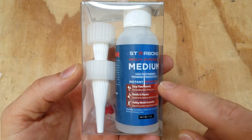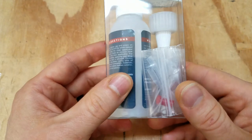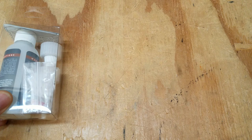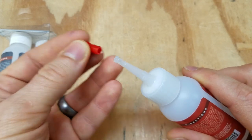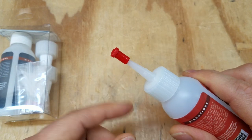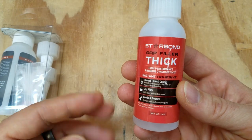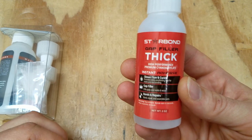Each of these two-ounce bottles comes with two separate caps and nozzles in case one gets clogged up. It also comes with a bunch of fine tips for getting into cracks and crevices — these are disposable, so take them off once you're done. Each bottle also comes with one of these clog-saving tips that has a little needle that goes into the very end, which is the thin part that usually gets clogged with CA glue. If you want to store these longer, you can store them in your fridge — just keep them away from food, as below 40 degrees is the optimal storage temperature for extending shelf life.